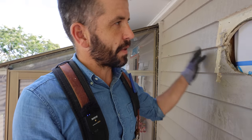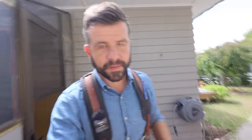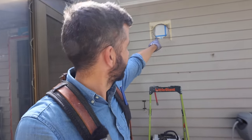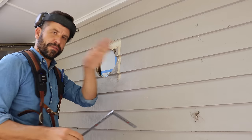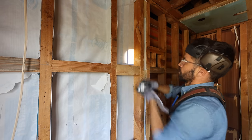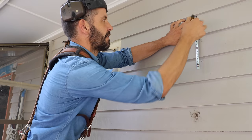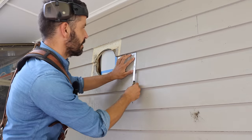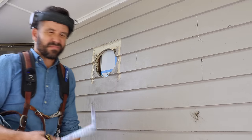Now this presents something I struggled with when I first started building — replacing weatherboards in the middle of a wall. You want to minimize the amount of weatherboards you take off, so you've got to surgically remove those ones. You find the studs in the wall — typically with weatherboards you look for nail patterns. Often the nails would be popped, but in my case the wall was open on the other side, so that's a lot easier. I just measure it up and transfer the marks out here. I'm trying to stagger the joins — the more randomized the joins, the better. It's less likely to leak and it just looks better.